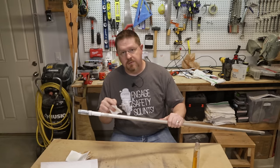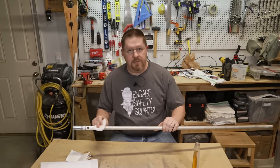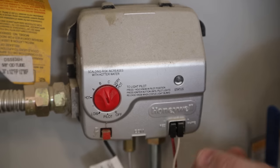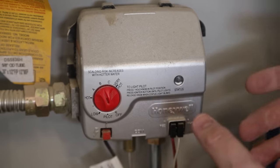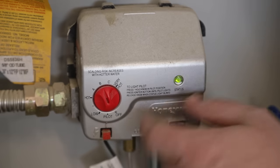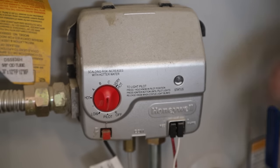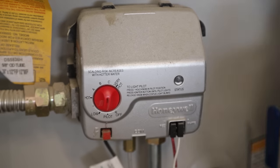This replacement rod came with a sticker wrapped around it and I don't want that sticker to flake off and settle to the bottom of my tank and potentially clog something. So I'm going to turn the heater off. It's a gas one, so I need to spin this dial over to the pilot setting. If your heater doesn't have a pilot, it may have a vacation setting. Or if your heater is electric, it's far easier to just turn it off at your circuit breaker or by unplugging it from the wall. I'm just going to twist this dial until we get to the pilot setting — you can hear the burner just turned off. It won't turn the burner back on, but it'll leave the pilot light lit so when I'm finished I can just twist it back to my desired temperature.